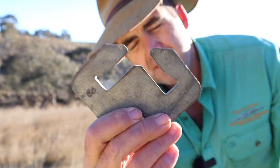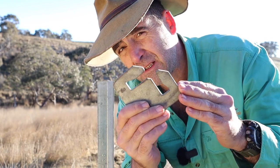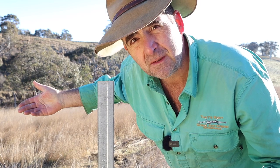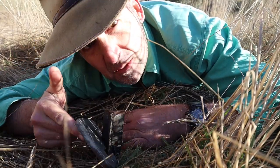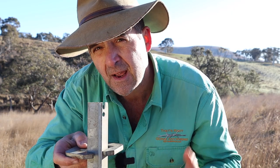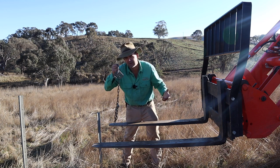You see all these different angles? Well they actually matter. They make this particular plate fit just about anything you can stick in the ground — whether it's a stock post XL, a regular size steel post, and it'll even fit the skinny little cheap imported models that you get from your local hardware store. As long as you've got a centimetre or so sticking out, this will pull it out. So if your post is crooked on the fence line or you've put the wire on the wrong side, you can simply fix this to any two free fins and pull any post out. Today we're lucky enough to have a tractor, but of course this will work equally well with just a high lift jack.